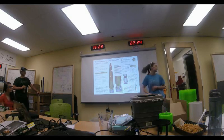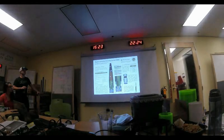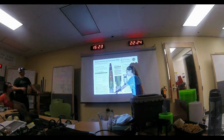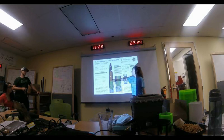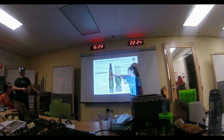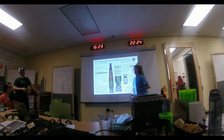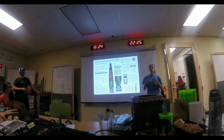Our final system is this one here. Looking inside the nose cone and the aluminum module underneath, we've got the cup for the drogue parachute, the cup for the main parachute, and the surgical tubing assembly that goes over the top of both cups — that's what initially ejects the nose cone when released. All of our electronics are down in what we call the keeper ring.